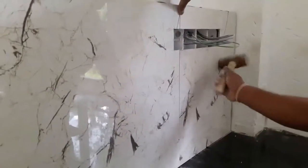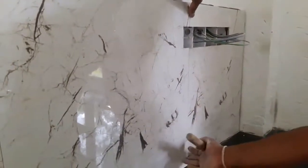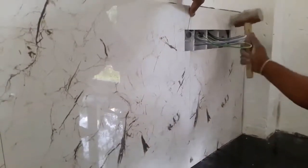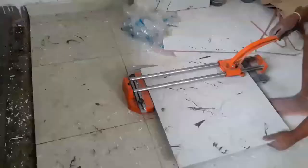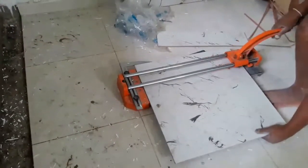Guys, the trowels that we are using have both a smooth edge and a notch edge. The notches are called teeth. The size of the notch determines how much thin set is left on the floor receiving the tile. For larger tiles, you need to use a larger notch trowel.